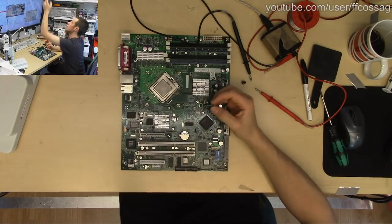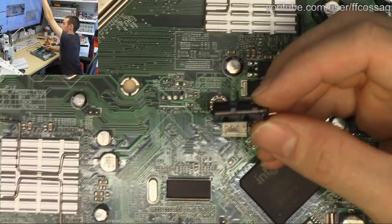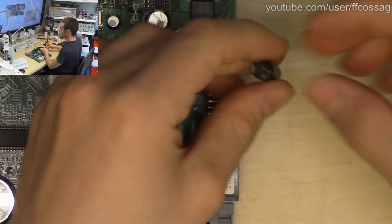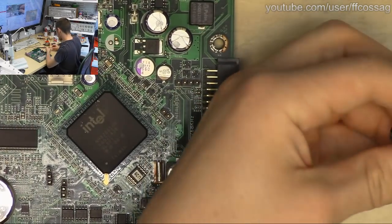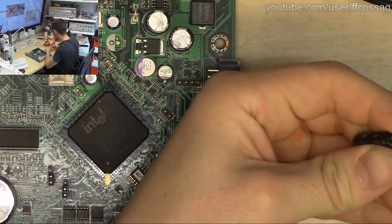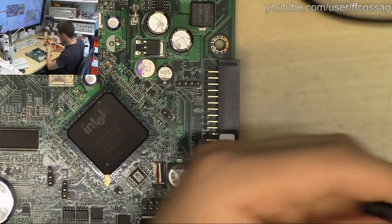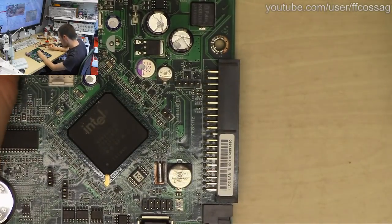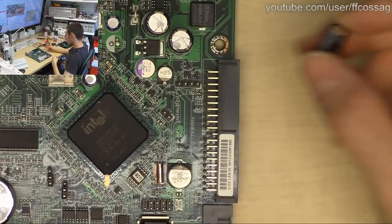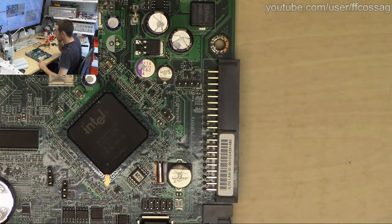So here's a 1000 micro, 16 volts, Panasonic FR. So let's just check the ESR on that. If it's better, we'll use it. The last cap was 40 milliohms. This one's probably better. Yeah, 27 milliohms, so this is going to be fine. I think we have clearance. Enough to mount that, yeah, plenty of clearance. It's no taller than those guys anyway. This is going to be such an easy job.